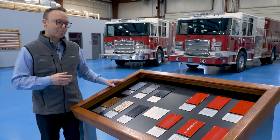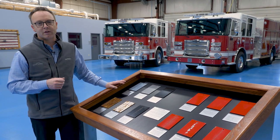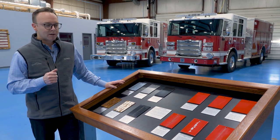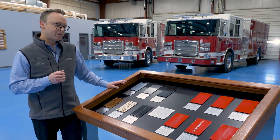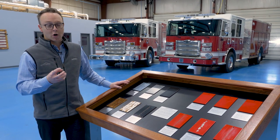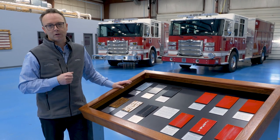As you can see in these samples, the e-coating process really does perform well throughout the 1,000-hour salt spray testing. I want to emphasize that e-coating is more than just a fancy way to apply primer. It's a complete process in a very controlled environment that guarantees 100% coverage by electronically charging the component so that the material is drawn to it.